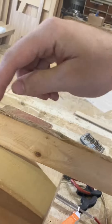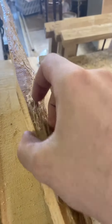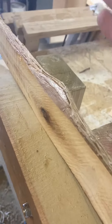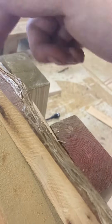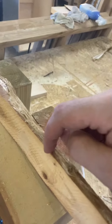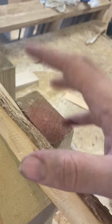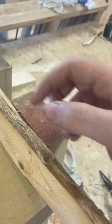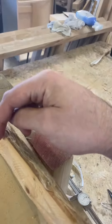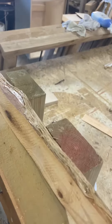We also want to round a bit off this edge here, because at the moment you can see it's a right angle. If we did that, we would keep the heartwood in the center but would probably end up going all the way to the edge of the sapwood — like on a longbow, a rounded profile. From what I've seen, the crossbow is a bit different in that it's more of a rectangle rather than an oval.